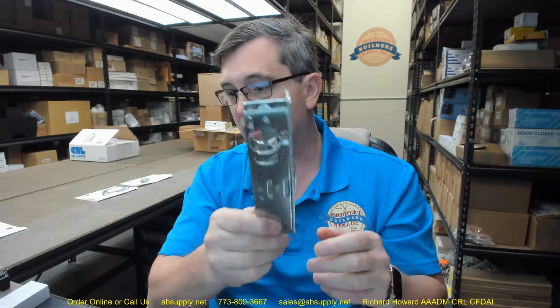Stamped inch and a half, inch and an eighth backset. This will take your typical 1 and 5/32 inch mortise cylinder or mortise thumb turn. Cam plugs — if you've got levers or push-pull paddles — will certainly work in this. Typical thread type, nothing to worry about, industry standard, unless you have a really strange cylinder. They do make inch and a half diameter cylinders known as master ring or mogul cylinders, and three-quarter inch peanut cylinders, but nine million times out of nine million and one, it's going to be the standard cylinder. Five-ply laminated steel with center three-ply hardened case plus hardened roller pin to resist hacksaw — thirteen sixteenths — and it comes with a couple of screws.